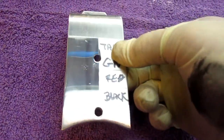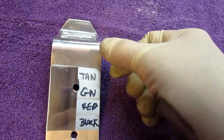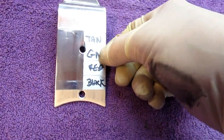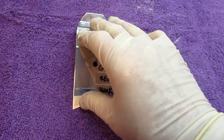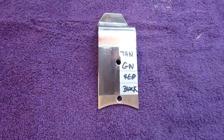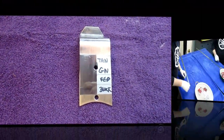And I think what I've shown is how quick you can go from 2,000 grit scratches, using those little 3M buffing pads, to a final shine. And I haven't even put the Flitz on this yet. If I Flitz this over, that even adds another layer of protection. So all good, usable information.